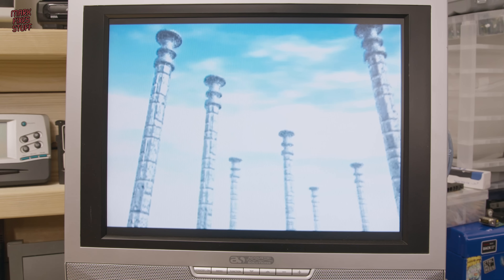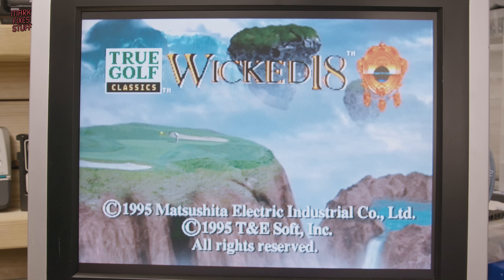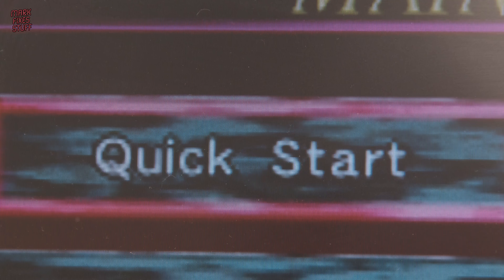On the subject of video, I want to show you why I want this particular mainboard — it's because it has the A-B switch. If you look at the screen close up you can see it shimmering with the interlaced 480i. When I flick the switch you can immediately see the 240p is much more stable. 480i and 240p — that's why I want it.